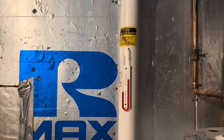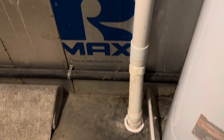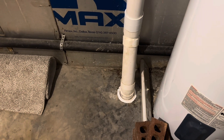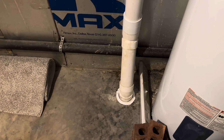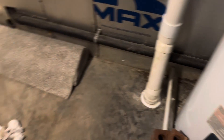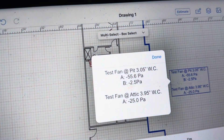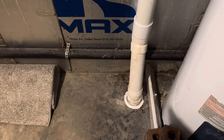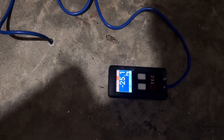We've got a test fan on in the attic right now. Originally we removed the fitting — it was just set into the hole that the company had cored through the slab, so we were able to pull that right out and put our test fan right here on the pit. We had minus 55.6 Pascals, and it was about three inches across the fan, so it was pretty leaky — a very leaky system. Our pressure right there was minus 55. Then we took and put the fan in the attic, and now we are at minus 25 Pascals.